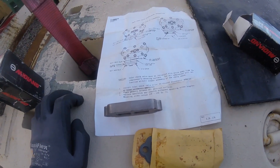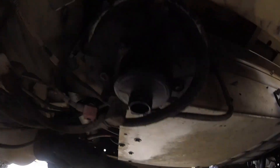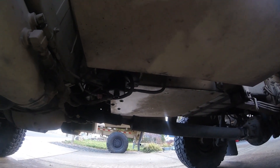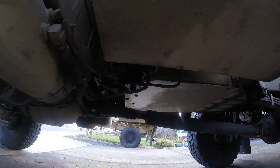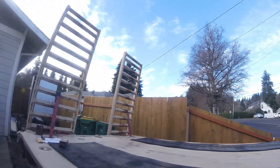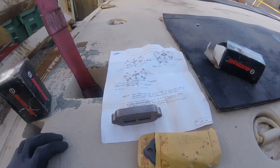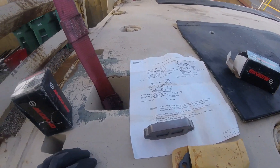It doubles as a piston ring seat on the actual air compressor pistons — it keeps pressure on the piston rings. If you guys remember, I have a little bit of oil vapors in my system right now, which is a sign that the piston rings are going bad or there's not enough pressure on those piston rings to keep them seated, so oil is getting past them. I'm going to attempt this fix first. I do have a spare compressor but I don't want to swap it out yet.